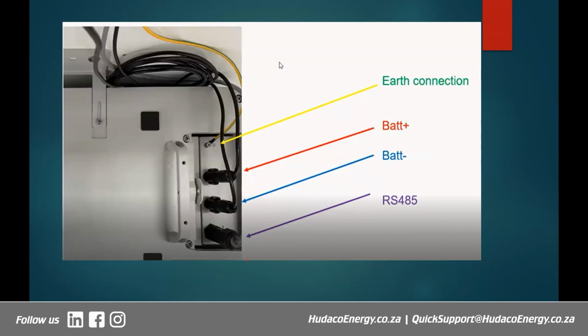And that's the reason why we were saying here, this bracket is supposed to force the installer to leave a gap. Why? Because this whole bunch of cables will need some room behind the battery to go behind the battery and go wherever they are going, to the inverter or some other components. All right. So the whole point of having this bracket here is to make sure that your battery leaves a reasonable gap between itself and the wall, which will then accommodate any connections and cables that need to be installed on the system.